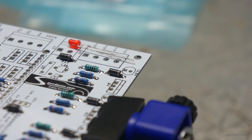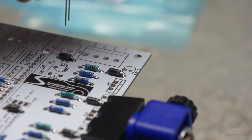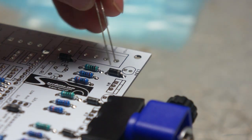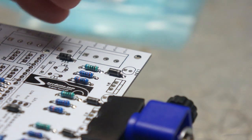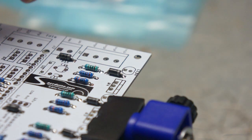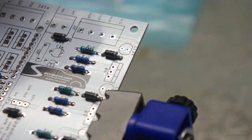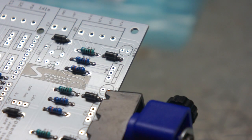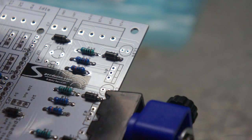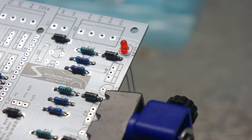As with the regular diodes, you do just need to be careful to make sure you get the polarity right. An LED has two legs — a long leg and a short leg — representing the anode and the cathode. On the PCB, you'll note that the LED markings have one straight side and a rounded side. The short leg of the LED needs to go into the flat side on the board.